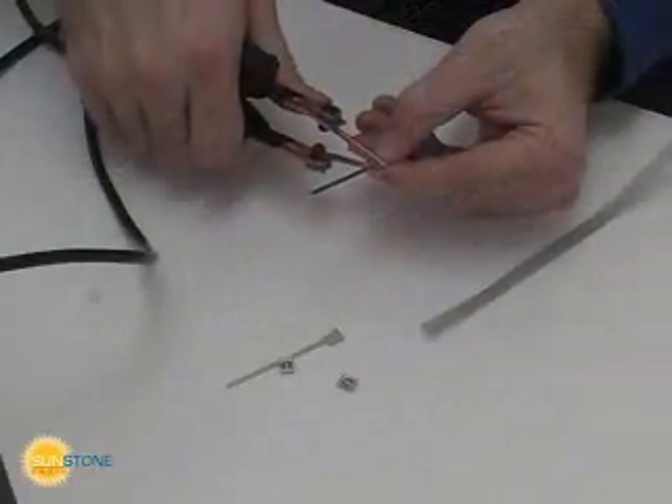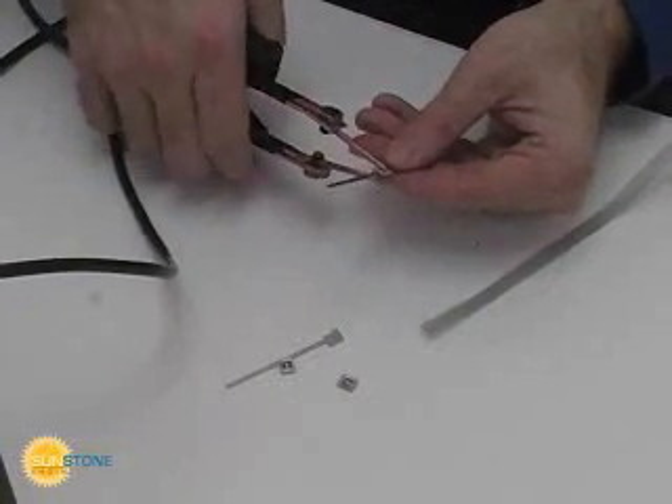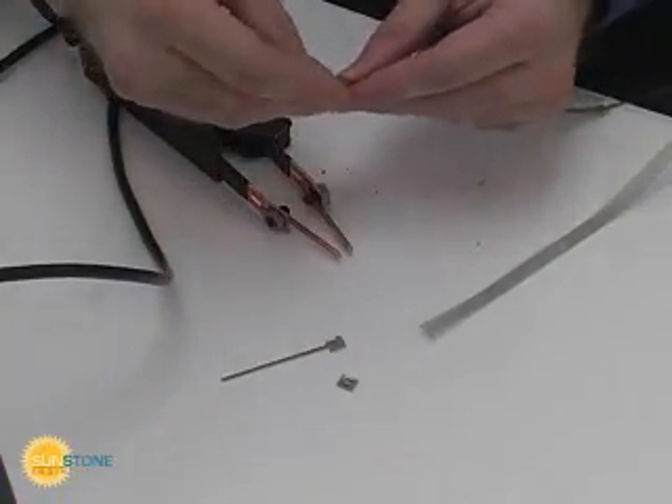All of these factors contribute to weld performance. But as a rule of thumb, when welding with a handheld attachment, use moderate pressure with an energy and length setting that produce a clean weld without melting the welding tips.